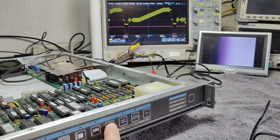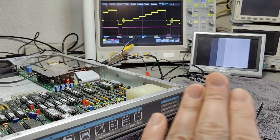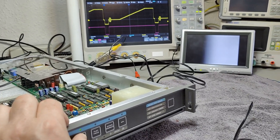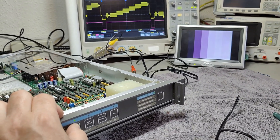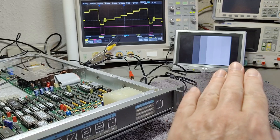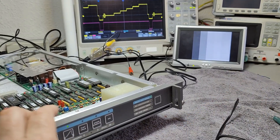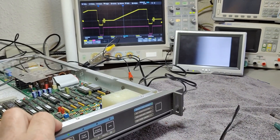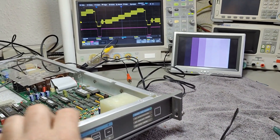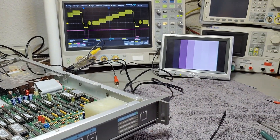Linear colors - I must admit that my LCD screen there is not super nice when it comes to linearity and handling different brightnesses and colors. It is definitely not a good reference screen for anything like that. You can see all the white colors just saturate and then you see almost no difference in any of these - that's because it's adjusted wrong. This pattern should be in the middle of the screen and you should see all the different levels with more or less the same kind of step - that's far from what I see here.